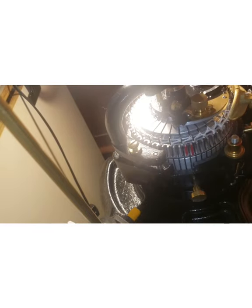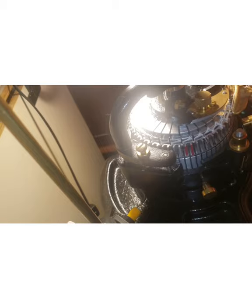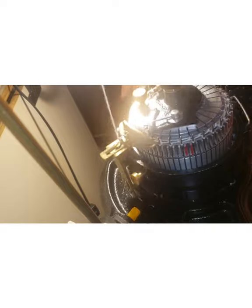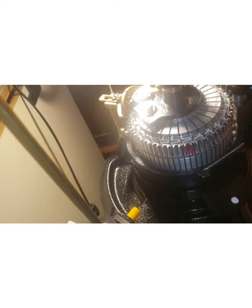Now, like I said, the timing forces the needles out so that they're matched up with the arrival of the yarn carrier. So my timing is fine. My needles are coming out at the right time. They're pulling back at the right time. I've got a sticky latch right here, but it's not dropping the stitch, so it's going to be okay. But that makes me think that I might need to adjust the weight a bit over here.